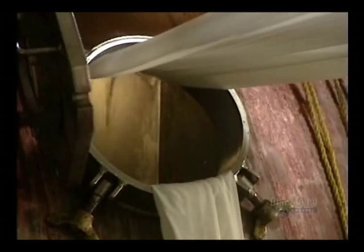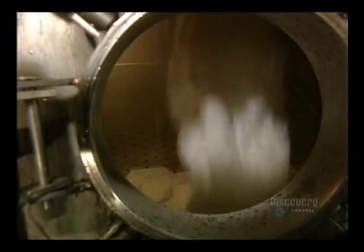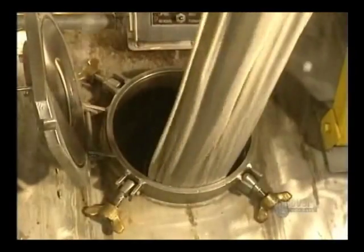This is done with jets. Up to 12,000 meters of fabric are placed in clean water into which colorants have been added. The solution is heated and the fabric soaks here for about 6 hours. Then it will be rinsed in lukewarm water.